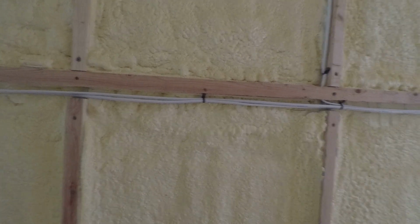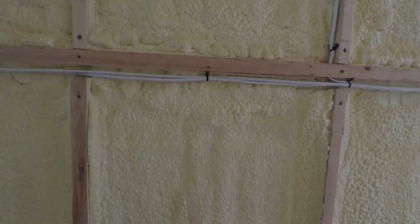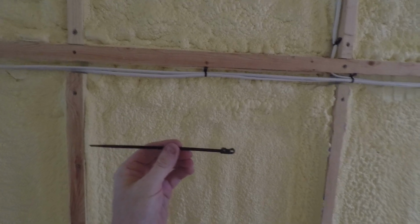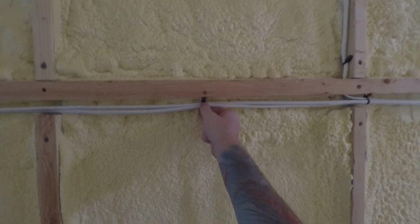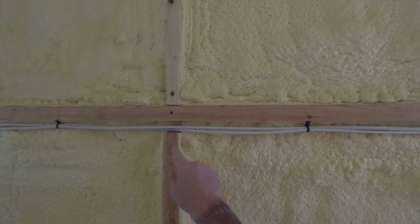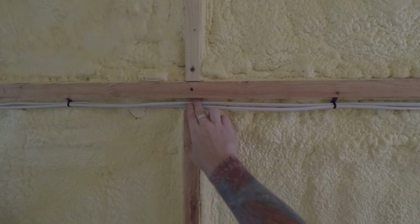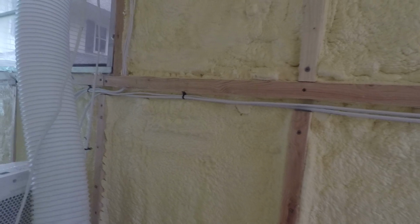All right, let me show you what I'm doing now. I am done wiring, I'm done installing the wires for DC, and now I'm using these cable ties. There are 8-inch cable ties. They have a hole for a screw here, and I'm using these drywall screws to hold these wires to the framing, and I'm basically installing it between the studs, because the stud itself was gonna serve to hold the cable. So I'm gonna have supports for the cables about every 12 inches.